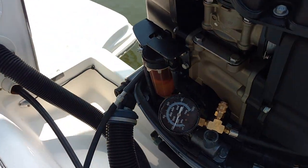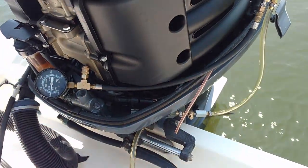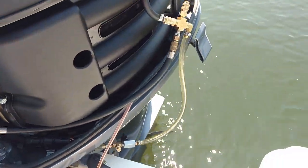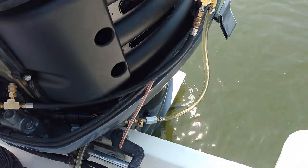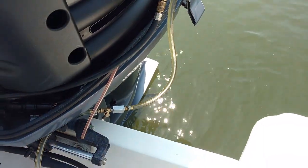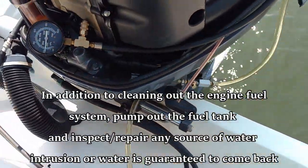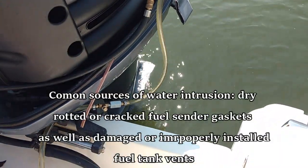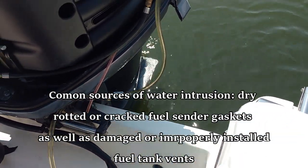Once we get this thing going — first things first — get the motor running, get clean fuel pushing through the fuel system, get the water out of the fuel system on the motor. The next step is to get this thing on the hill and do a real teardown, get the fuel system completely cleaned out, tear out the VST pump, get our injectors sent off for cleaning and see how they test. We've lost 18-20 PSI just sitting here when the injector should be closed. Alright, we're about ready to go ahead and crank this beauty up.